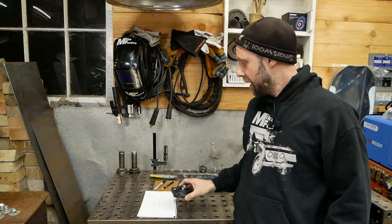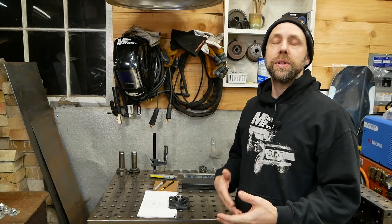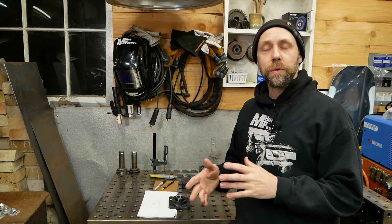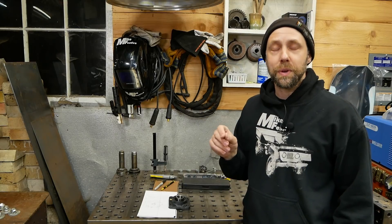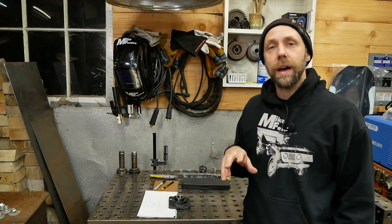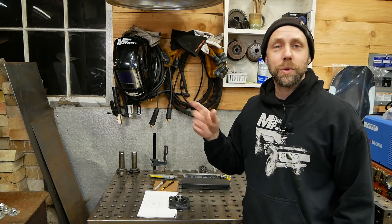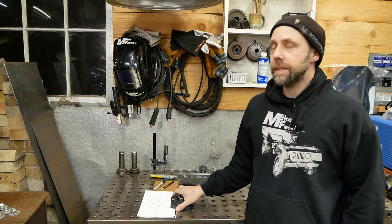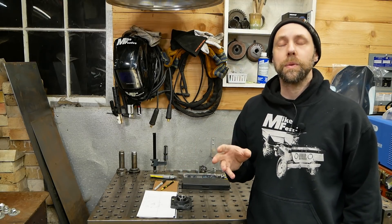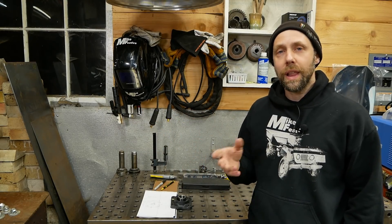So the simple bearing part we measured here — as you guys can see, a real simple way to go about this mainly with calipers, and we got all those specs on paper. This gets you in the mindset of how to start measuring parts, and as the series goes on you'll get more complex with it, figuring out angles and reference points. All we need to do in Fusion 360 is make four lines and draw a square, reference four holes around the outside edges and one in the center. As the series goes along we'll get into more complex parts with some more angles, slots, and hole patterns.